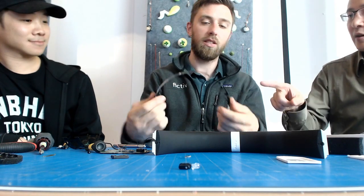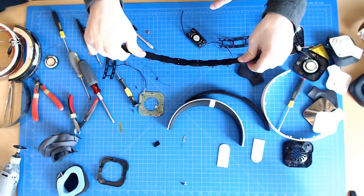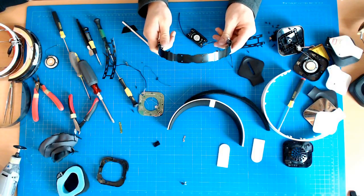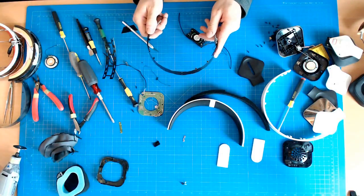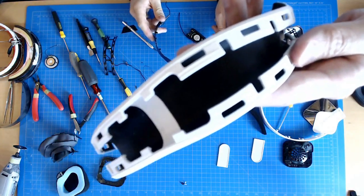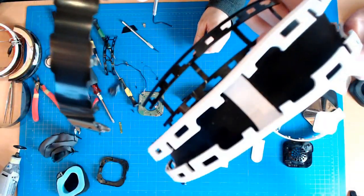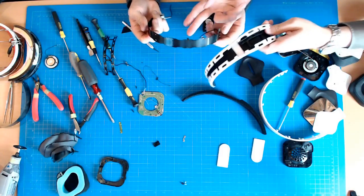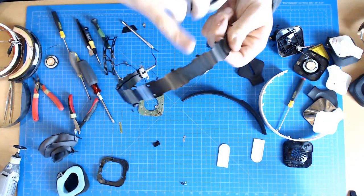Right, so those are all stamped. They're stamped in the flat. And it doesn't even spring back. Or I mean, it does spring back, but because it's heat treated, it actually stays pretty strong. The hooks are there because it actually has to sandwich this piece between the plastic parts to just keep it from pulling out. So I understand the sole purpose of the inner structure. It sandwiches and the hooks basically pull them up. So folks can see that this sits in there, and then these hooks do that.